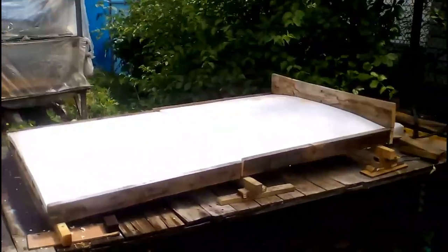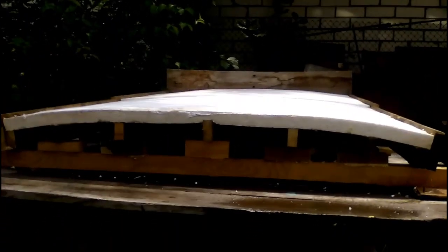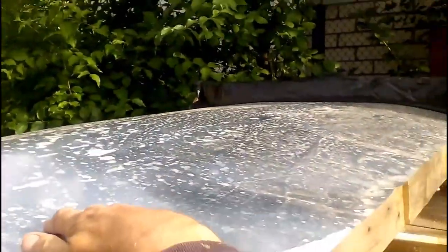The new solar heater is more complex. Wooden boards are added, fixed to the battens of the sections with screws. These boards are needed to mount the steel sheet using screws, with a recommended interval of about 30 centimeters between adjacent screws.